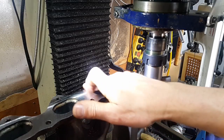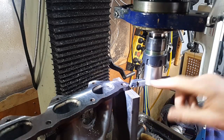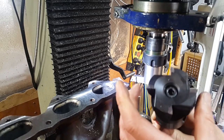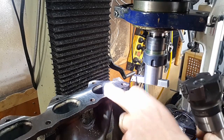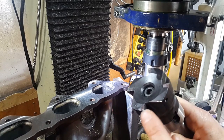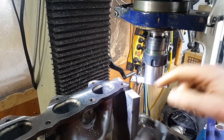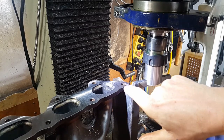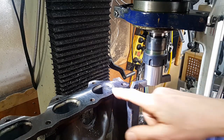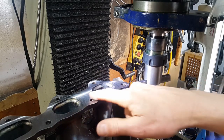So that's the rough pass all finished. What we'll do now is do a finish cut with the fly cutter. My face mill is only this wide so I had to do two passes along here. The inserts in here aren't particularly good for cast iron either, whereas the insert in the fly cutter has always been quite successful on cast iron. So we'll just run a finish pass using the fly cutter and then we'll see what sort of finish we can get.